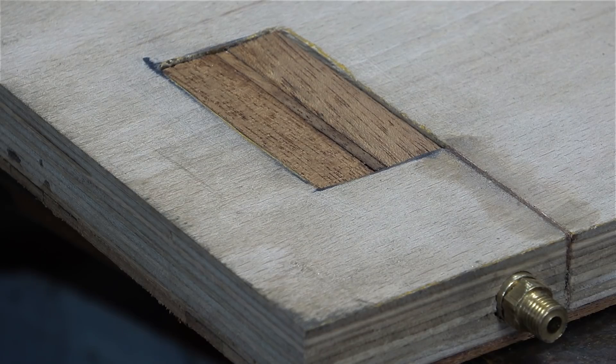Although I haven't shown it in the video, I fitted some more planking using beech — a white wood. This whiter beech is much softer than mahogany, and by using an orbital sander I should be able to get the entire area very flat. With a bit of luck I won't need to use any filler.